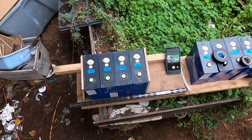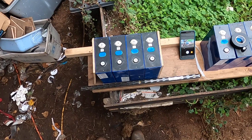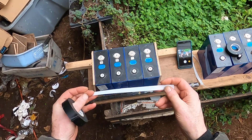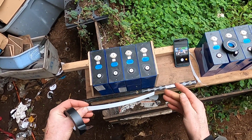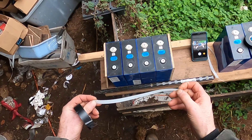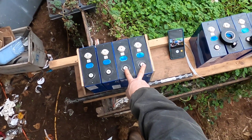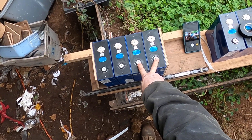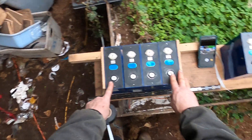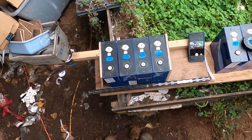I've got a new bundling and compressing strategy for these LiFePO4 cells, which are going into my large battery bank. The package strapping worked pretty well for the 12-volt battery I built previously, but it didn't hold the cells as securely as I anticipated — there was still some movement. I want absolutely no movement with these cells because I don't want the terminals damaged. The terminals will be connected with rigid copper bus bar, and if there's any expansion in the cells it could rip out terminals or screws.